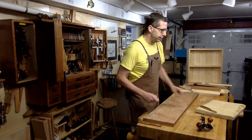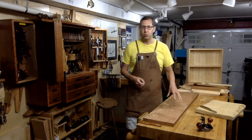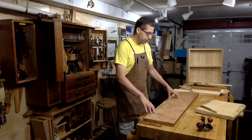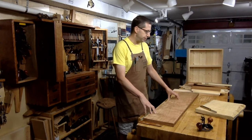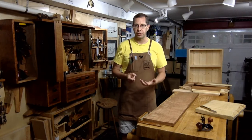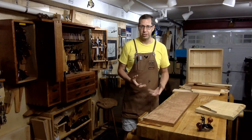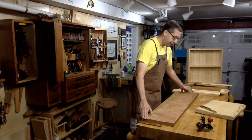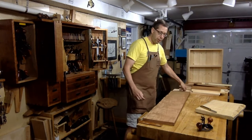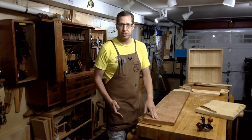In a previous episode, in a previous week, I was talking about sawing, and one of the fastest ways to flatten a board is with a saw. And I was actually using this board, or one of these boards, as a demonstration. When you are milling up your parts for a project, the first thing you should do is be sawing those parts closer to size. Because instead of now having to flatten this piece of cherry over this 48-inch length, if my part is only 12 inches long, now I just need to flatten that board over that 12-inch length.